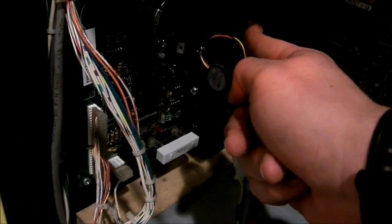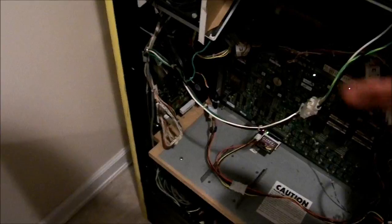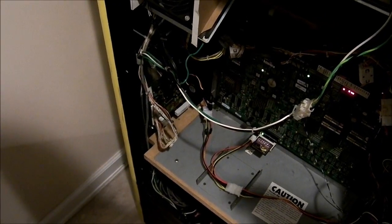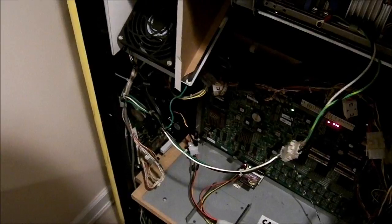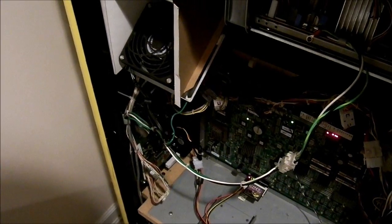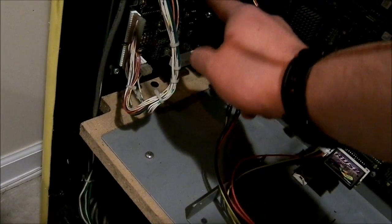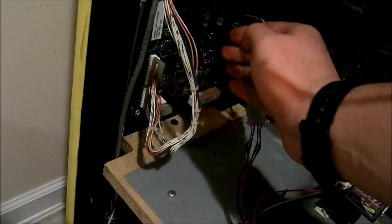What this heatsink is, it's the drive transistors for the feedback steering, and I think these are 80 millimeter, 60 millimeter fans. I did this so I could take the air off of that, because that thing was literally overheating. I literally just tonight popped that board off, replaced the transistors with the new ones I got off eBay. I got like 2 for 20 bucks, which is a pretty good deal because everywhere else wanted like $24 each. I replaced those because I figured if they were overheating before, might as well get new ones now. Then I just got fans and steel or sheet metal screws, and screwed them right into the heatsink here, and that works great. It keeps everything cool.